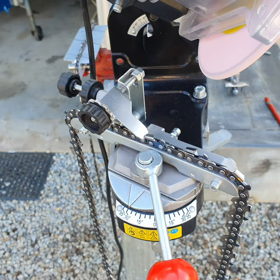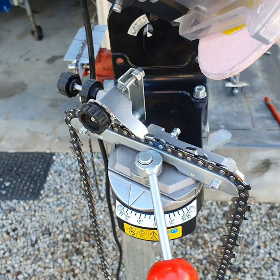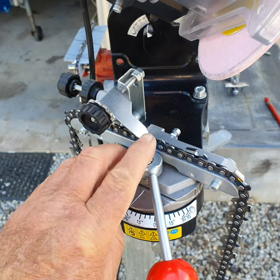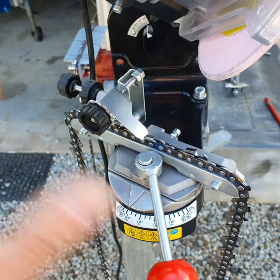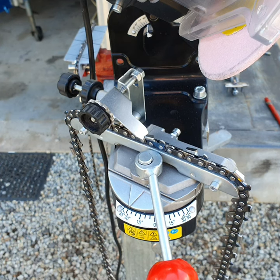This is a 20-inch chain, so there are 18 teeth on the left-hand side and 18 on the right-hand side. That is how you use the grinder — nice and slow, just take your time. If you go too fast, yes, you will overheat. Generally speaking, most of my chains only need just a light grind — just a touch. It's like when you sharpen a knife.